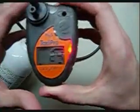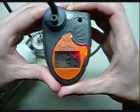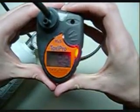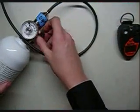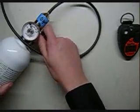You'll notice the gas values will start off low and go up higher, all the way towards 25. As you can see, right now it's showing 24. I just adjusted it up to 25. Go ahead and take that off. Close off your cylinder of calibration gas and let this sit as it goes back down. Make sure the Toxipro goes all the way back down to zero before you go ahead and test it later.